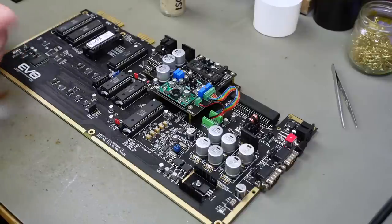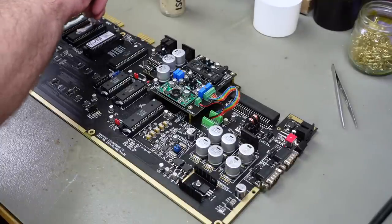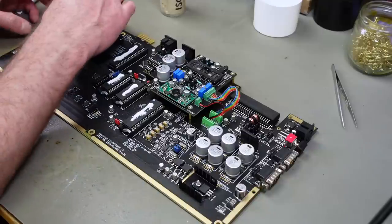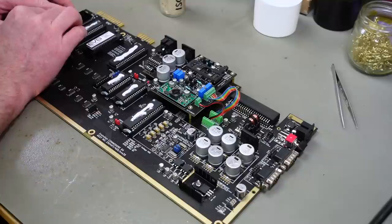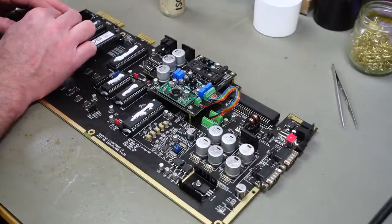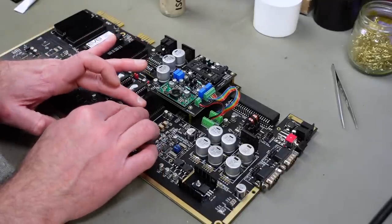And I'm applying the heatsink plaster to the chips because the heatsinks are a bit larger than the chips. You don't need very much of this. And then we just apply the actual heat sinks. Just moving them slightly and get them as straight as possible. Just wiggling them a tiny little bit to spread the adhesive a bit.